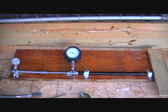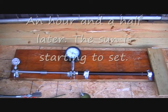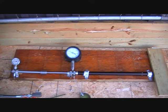We've held at pressure between 8,000 and 9,000 psi for about an hour and a half. There's a little bit of pressure drop, probably leakage back into the pump, but we're going to depressurize, measure, and then we're going to take it up to the final burst pressure.